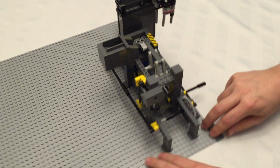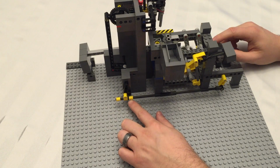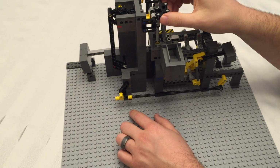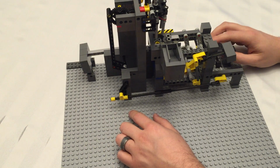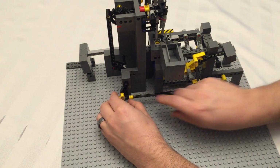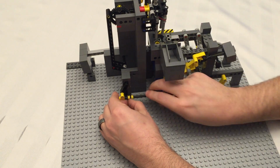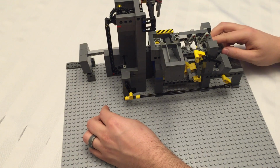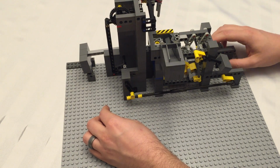oh, what do you know? I have another timing thing to set up. Right here. Haven't set this up yet. I noticed it because this isn't coming all the way to the end. So I'm not quite at the end here. So what we'll do is slide this in. This gets us closer to the elevator side by sliding further in this way. That's firing too tight.